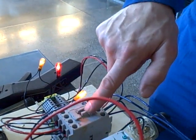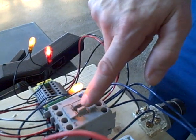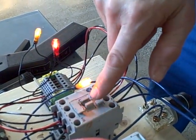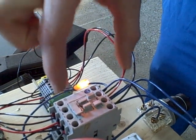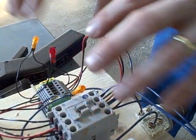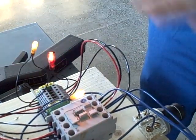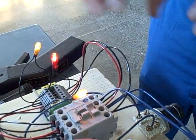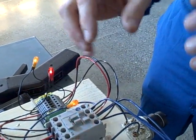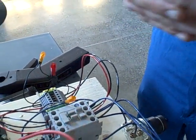This one circuit breaker, or contactor, is the one missing link to connecting the two generators together. Right now the breaker is open. We're measuring the voltage drop across each breaker contact with the light. So when we see bright lights, that means a big voltage drop across the contactor, and we do not want to close it in that condition. We want to wait until the lights go out and then close it. When we close it, those two generators will be locked in sync with each other.